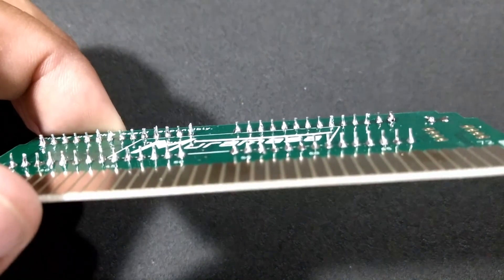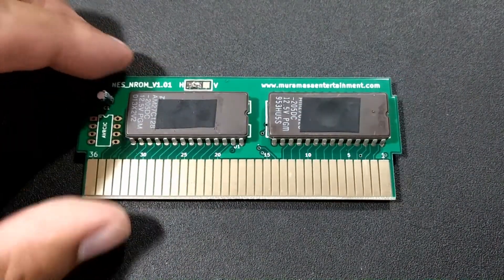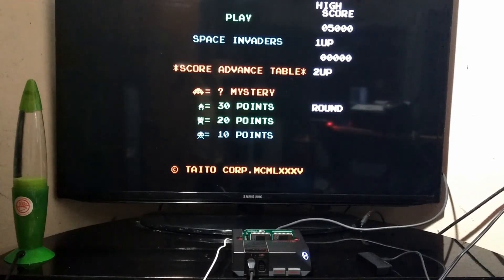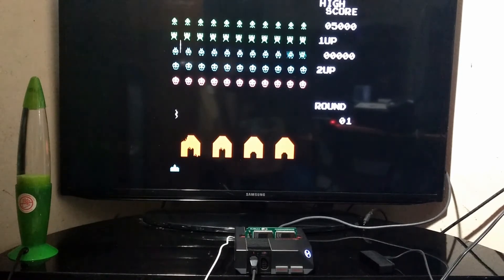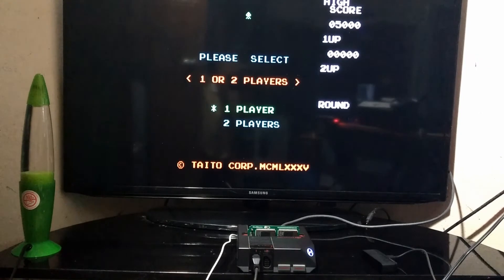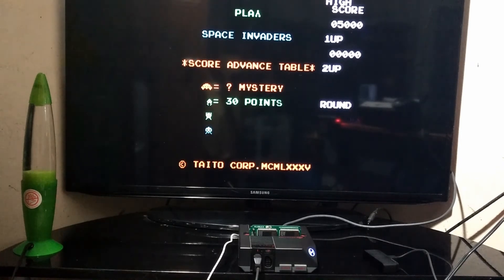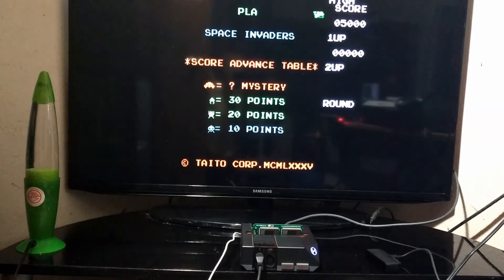The capacitor solder is done, and that's pretty much it. Now, the most important question — will it work? The game works perfectly. I'm using the Retron HD console to HDMI — it's a clone console. I place the PCB with the chips facing me. All NES reproductions will always have the PCB facing toward you or toward the front of the console. Make sure the EPROMs are covered with any type of tape or sticker to prevent damage from UV radiation. Slowly insert the PCB into the test unit, and there you go — it works perfectly.